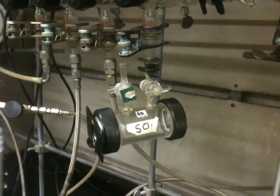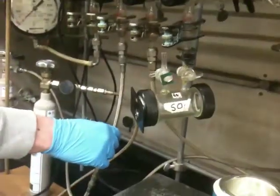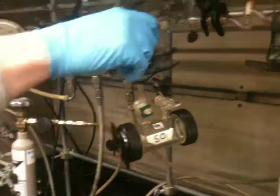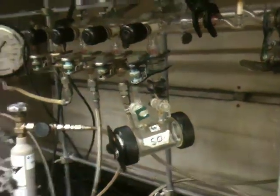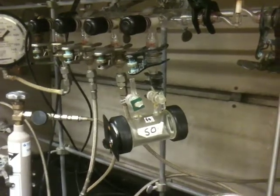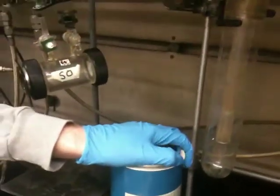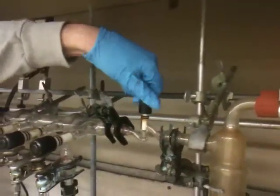Let's say I'm going to fill an SO2 cell. First thing I'm going to do is evacuate the manifold — this is open. I'm also going to open the valve for the line to the SO2, and open the valve for the sample cell because I want to evacuate the sample cell too. I'll open the sample cell stopcock. You can hear the pump is now doing a little more work. I would wait some amount of time to allow all this to evacuate out. Once I have a good vacuum, I can put the liquid nitrogen trap on.